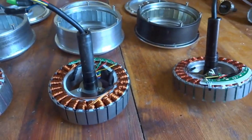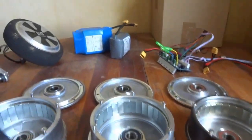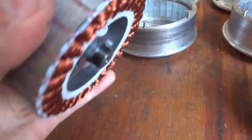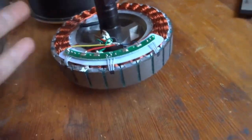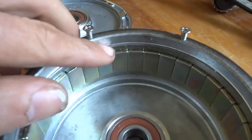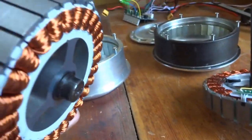These different motors are all about the same weight and the same size — 36 millimeters. You can take up the rubber easily with a screwdriver, and with this one you can remove the stator. But removing the stator was very difficult. This one you can already guess is a 250-watt motor, and it only has 20 millimeters of height, with magnets about 2 to 2.5 millimeters in height and 20 millimeters long, with lots of space inside.